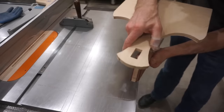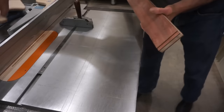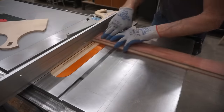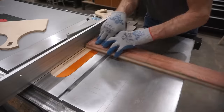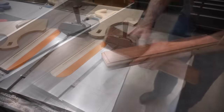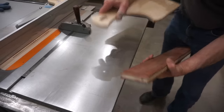After cutting the cheeks on that first tenon, I use one of the tool tote ends to gauge the thickness of the tenon and see that I can raise the blade ever so slightly to make the tenon thinner for a good fit in that mortise. And with that nearly imperceptible adjustment, I was able to adjust the tenon width for a snug preliminary fit in the mortise in the end of the tool tote.